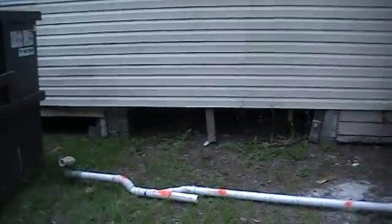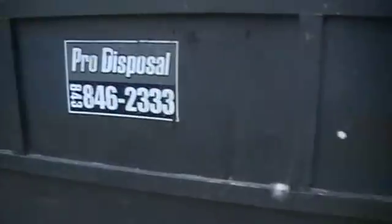And also, I don't know if we can look up underneath here. Oh yeah, you can see it there. You see there's a gap? I've got to turn the camera like that for you. Alright, so that's looking up underneath. See how the siding's just padded out away from the house. Just kind of strange. See that? So that's something that we can fix later on when we address the whole siding. But maybe we should pull that inside wall back in so that you have nice straight interior walls, and we'll deal with the outside walls later.